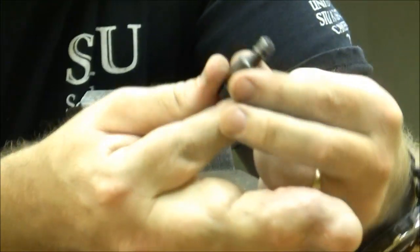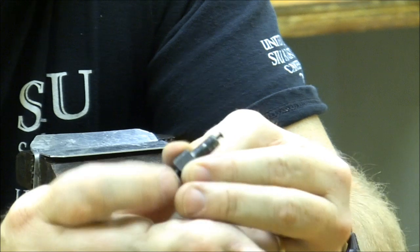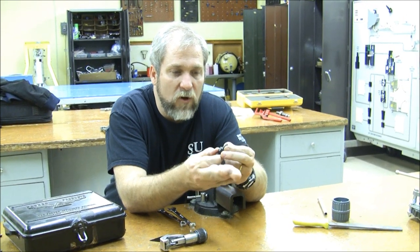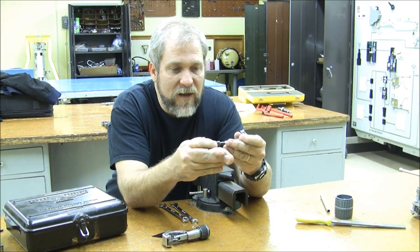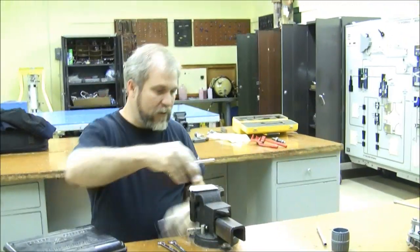This little beading tool actually spins along on the inside and you use wrenches. The flip side is you have to buy one of these for every size tube you're going to bead. Start by threading this all the way out, and you can insert this down into your tube just like we did on the last one.